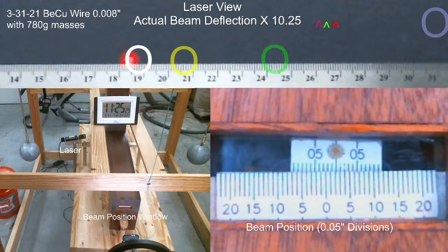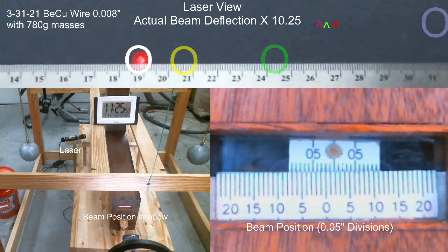Grains being one of those oddball units of measure. I'm accustomed to it because we used it all the time in the air pollution control business. 1 grain is 1/7,000th of a pound. So I could take the weight information he gave, and I could figure out what the American wire gauge number would be today, and it actually worked out to be about 30 gauge. So I thought, that's easy. I'll just get some 30 gauge copper wire and that'll work.